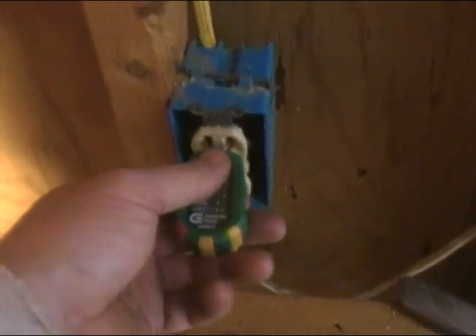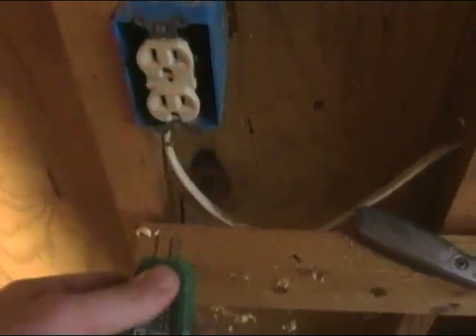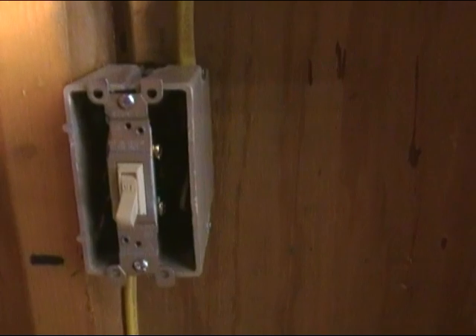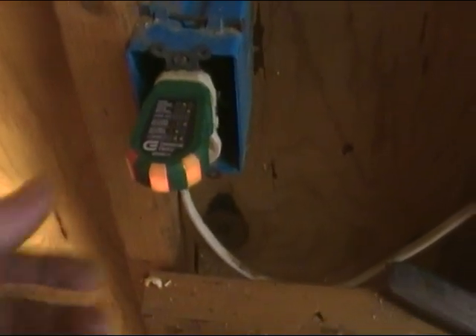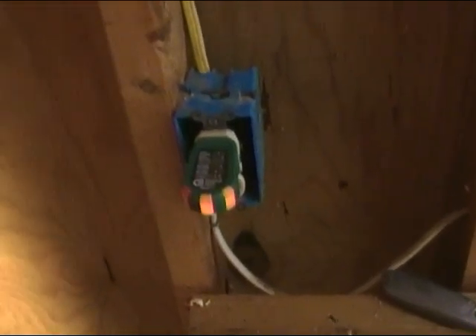One more thing before I let you go - I went and flipped the power back on. Let's make sure everything is working correctly. As you can see, these two lights here are lit up and that's what's supposed to happen. Go ahead and check both of your outlets. As far as going up to the switch - we ran that wire up along the joist and into the junction box up there, got it rolled up and tucked in right now. We'll make the connection there when we get ready to hook up our light. Just make sure everything's good to go when you're done. These little outlet checkers you can pick up at any home improvement store - they're a handy thing to have. Friends, have a great day and we'll see you next time.